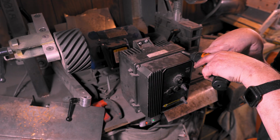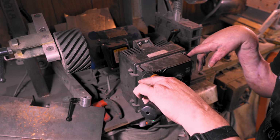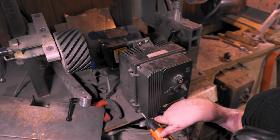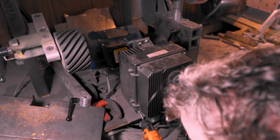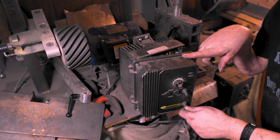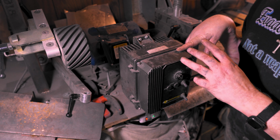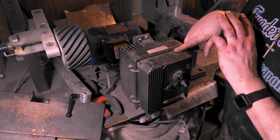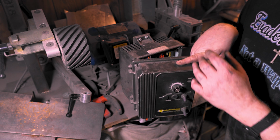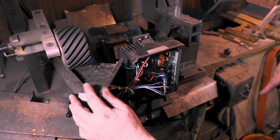Alright, let me get to that. Luckily, these screws stay in. Hopefully. Alright. I already turned it on to make sure there's no power. Even though it's got a switch on here, I would be safe and disconnect at the breaker, because you never know if there's like a capacitor that might be, anyway, electronics, it's always good to make sure it's cut.